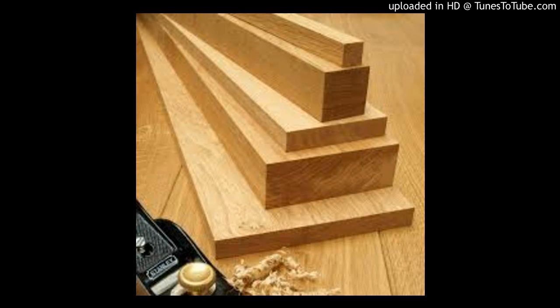So the pile, pier, joist and handrail post interaction. Now I just took the easy way out and I just moved the post. Is that the right thing to do? And again, it's going to depend entirely upon your job. This particular job just has a curb and nothing, you don't need to worry about any handrail on that. But in a case where the piles are driven from a barge, and the piles are very, very expensive, your primary concern would be reducing the number of piles. That would, to me, be your main criteria. So yes, it wouldn't matter in a case like that. Maximise your spans and reduce the number of piles.